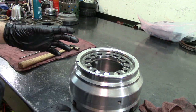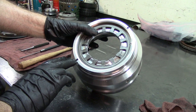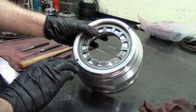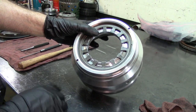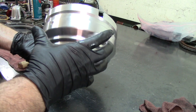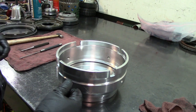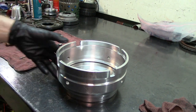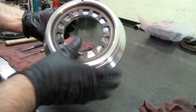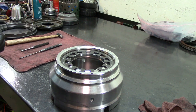The other option is just to replace the whole piston. The little screen filter - the little orifice - if you get a little bit of contamination, friction contamination, or metal contamination, it'll block that little hole and cause some issues. You're going to have fluid not bleeding off and probably some bind-ups on the upshifts and downshifts. I'm going to go ahead and start assembling this drum - I just wanted to show you what I've been doing to fix the problem on this particular unit.